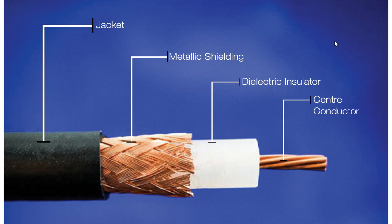Typical radios are at 50 ohms input. If you can get a coax that is at 50 ohms, that would be best. Or the closest possible, you know, 75 will still do the job on shortwave. There's not going to be that much of a loss. On transmit, it's another story. Here, this video is talking about receive only, not transmit.